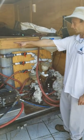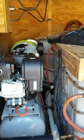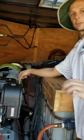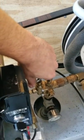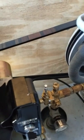The next step is you got to start the air compressor. Start it by pulling this gray lever here — this lever has to come forward, that's the choke. You also have to make sure that the air valve, which is on top of this air compressor, is pointed up like it is right now. If it's leaning down it will be harder to start the motor. You want to start it with this up, but then before you can use the compressor you got to pull it down.